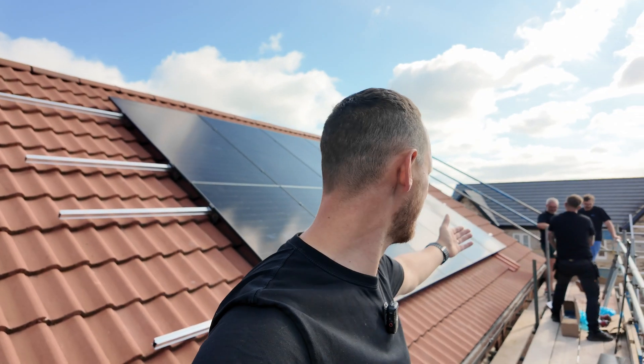While I've been downstairs building up the Anker Solix, Jason has been up on the roof. He's got his 10 JA435 bifacial panels on with bits of rail sticking out at the ends — we could have fitted more panels at each end but the customer has a budget and we've worked to that, giving us a 3.68 inverter teamed nicely with 4.35 kilowatt peak of solar. We currently have Ian and Aaron from Anker Solix here to commission the battery, so we'll head downstairs, get it commissioned, go through the app with the customer, and show you how it works.